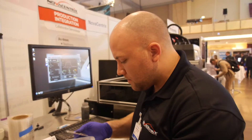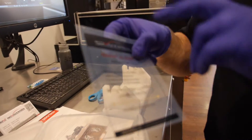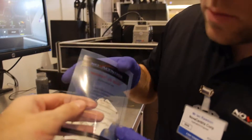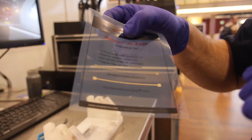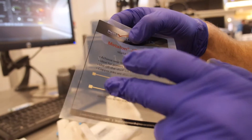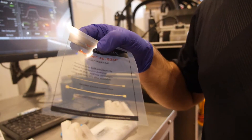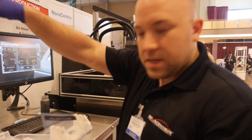How many designs are possible with printed electronics? A lot. One really interesting area is inkjet, which is digital — you can put a different image every time. In this case you have a fairly thin layer of ink, maybe one to two microns. With this you can make things like RFID tags and switches. RFID is radio frequency identification — current flowing through the printed trace becomes an electromagnetic radio wave, allowing communication between a chip placed on the tag and a base station elsewhere.